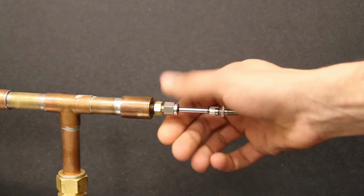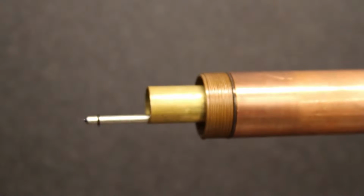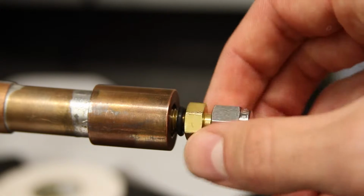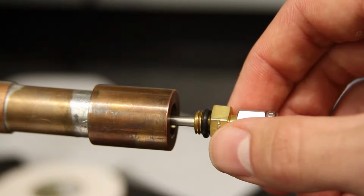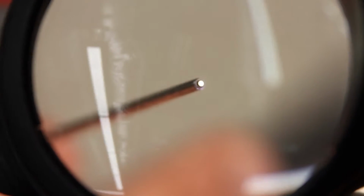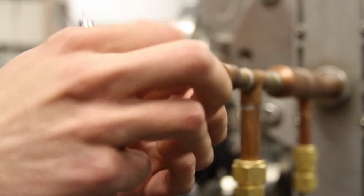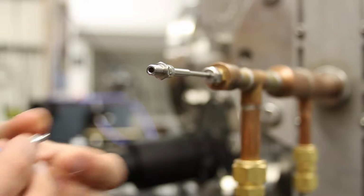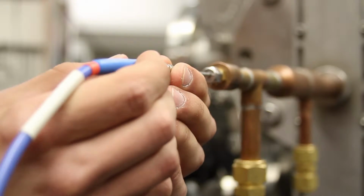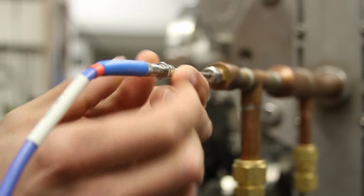We wanted the core of the probe to be easily disassembled and removable. As a result, the cap and the butt of the probe were designed to be threaded, and O-rings were incorporated in order to retain the vacuum seal. We wanted the core of the probe to house the fiber and feature a lens which collimates light into the probe. The back of our probe needed an easy way to connect to spectrometers that we already have in the lab. We chose to use an SMA connector on the core of our probe so that this was possible.